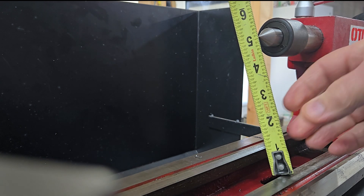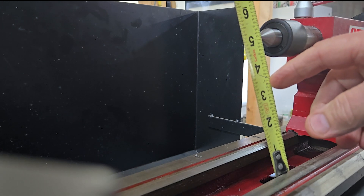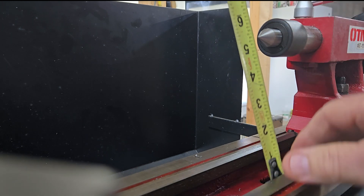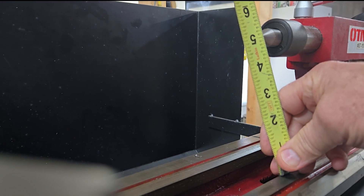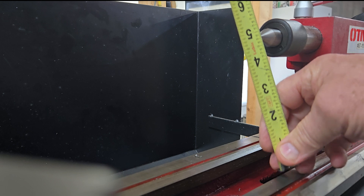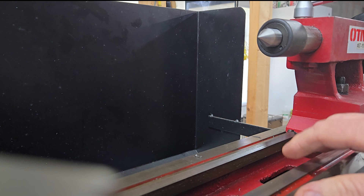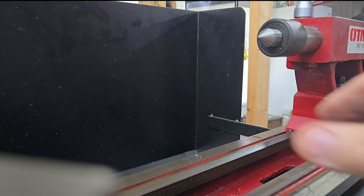As you can see, I have five inches here. So the biggest work piece I would be able to put into this lathe is 10 inches before it would hit my way. So I'm measuring five inches to the center — that would be the radius. I double that to get the diameter, which makes it 10 inches. And always round down, never up. If you round up, then your work piece would be hitting the ways.